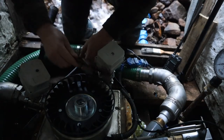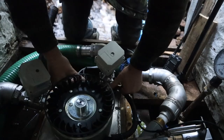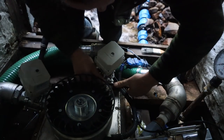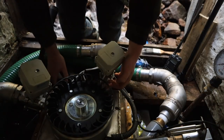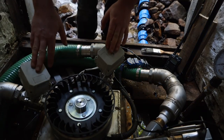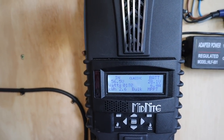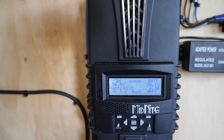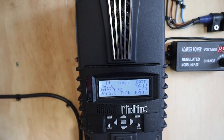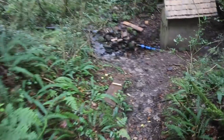We're seeing 177 watts - that's significant. It seems the best we saw was 177, so we went from our starting number and I think we managed to get about 10 watts there, which is significant - it all adds up. It's not quite at the very top, it's a couple of taps down from the top, but we've added another 10 watts to the system. Back at the power shed, with just that singular nozzle we're up to between 177 and 180 - that's at least 10-12 watts gained. We could do that on all three other nozzles.